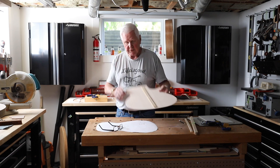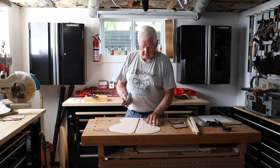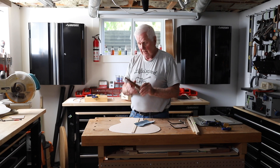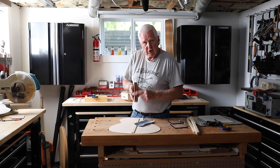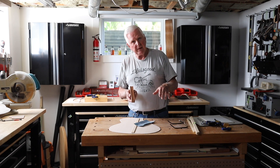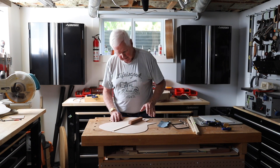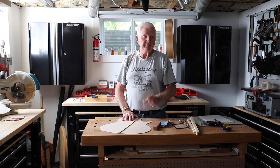What we need to do first is sand this all down. This is my little sanding jig — it's simply a six-inch piece of mahogany, and it's curved similar to the curve on a rolling pin. It's going to go down on here like this, so when I sand this down it's going to put a nice arch on the back, which will look terrific.